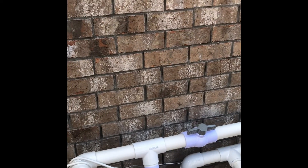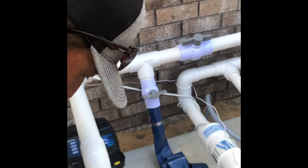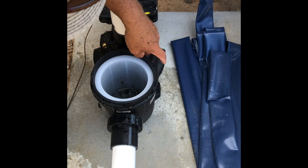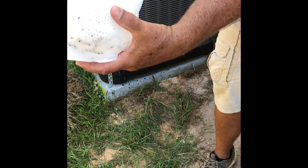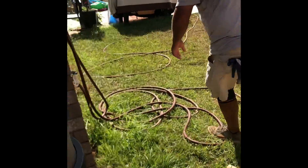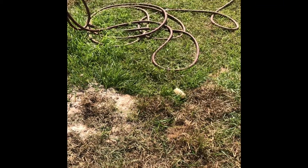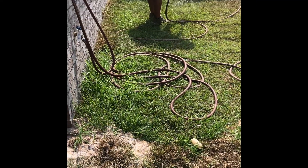This is the basket that you turn off — it turns that one off too. So I've got my pool off now. I'm going to clean this basket and that one. All you got to do is lock it right there. See, it's got a gasket in there too, so you want to be careful it doesn't fall out on you. Before I put it back on, I always make sure there's no grit in there — it'll mess up the seal. It's got some rock in there and stuff, knock it out. You want to take the hose and get it sparkling clean.